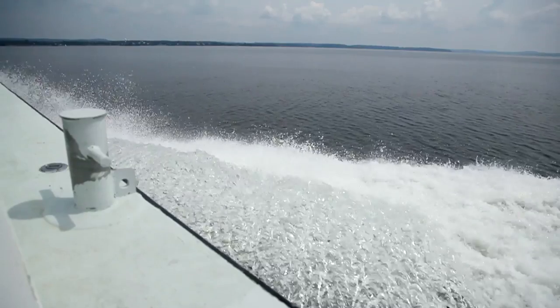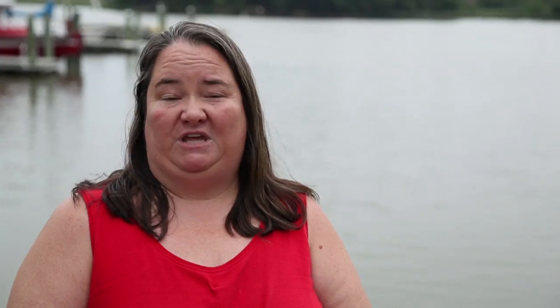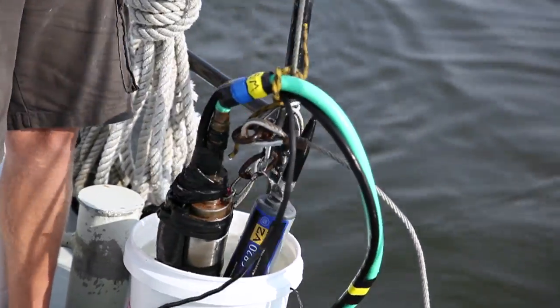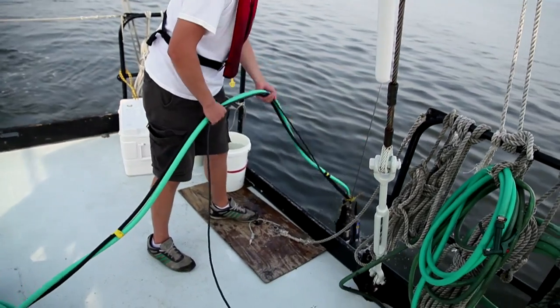What we'll do is get on station and collect samples and readings. We're collecting oxygen, temperature, salinity, and pH. Each one of those comes in a YSI reading — a meter with a lot of electrical components in it. It is attached to a submersible well pump that we put down into the water, which gives us readings comparable to the same depth that we're taking our samples.